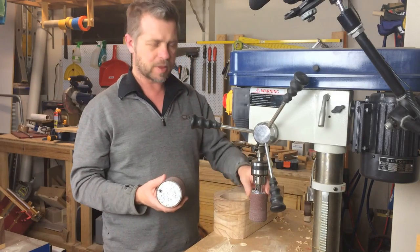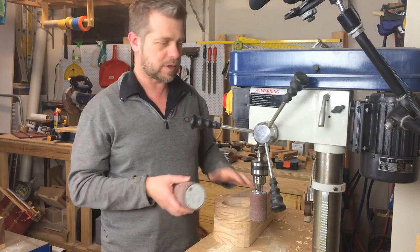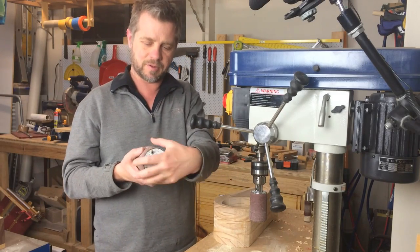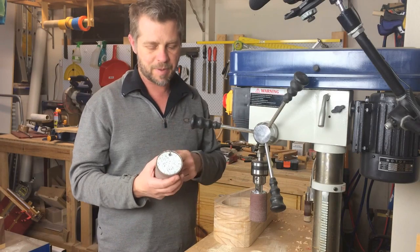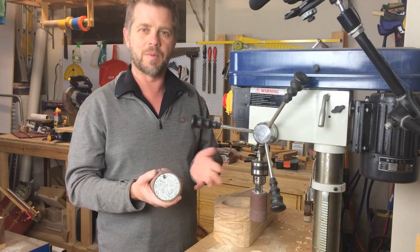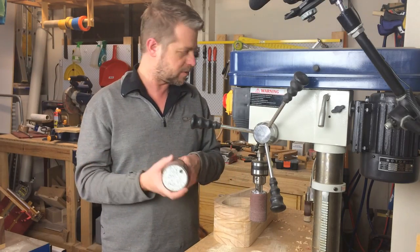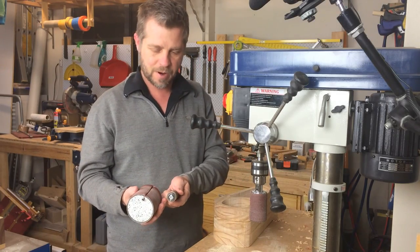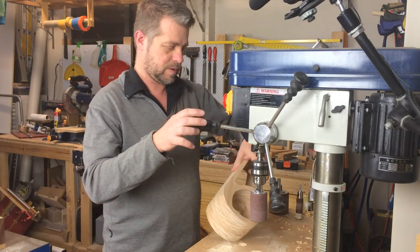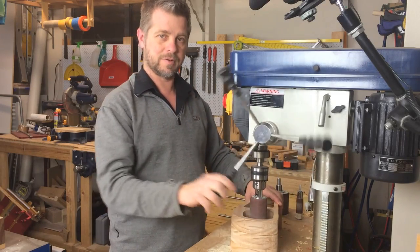What I've got are these little inserts that go onto your drill press — they act like a spindle sander. There's a few different types. There's some with a sleeve that slips over; this one just uses normal sandpaper. I reckon these are the ones to get because you can use whatever grit you want. It's easy to get from any hardware store and you don't have to special order any sleeves. I've got various different sizes. It works like an oscillating spindle sander.